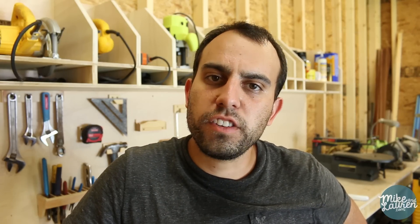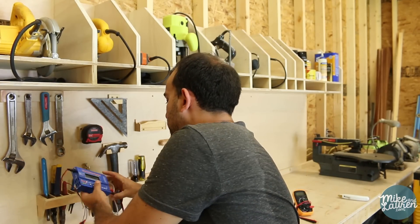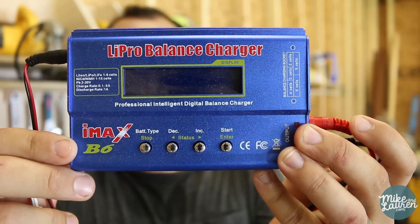Let's talk about the essentials if you want to make your own lithium-ion 18650 pack. First are the batteries themselves. Second is a balance charger made for lithium-ion — I use the IMAX B6, which I got off eBay for $19. It balance-charges the pack, so when we wire everything together in groups of 12, the charger charges each cell individually and keeps them all balanced. There's an issue with overcharging lithium-ion: going over 4.2 volts can cause a fire or destroy the battery, and repeated overcharging decreases the battery's lifespan.